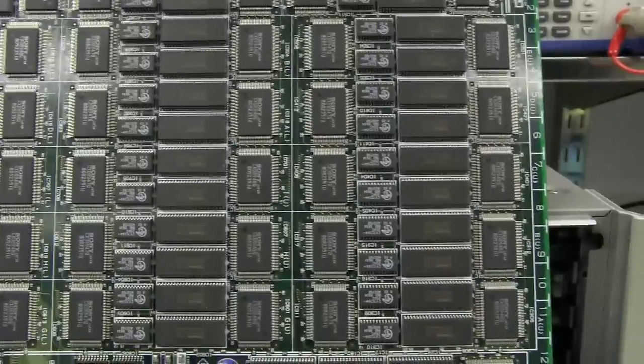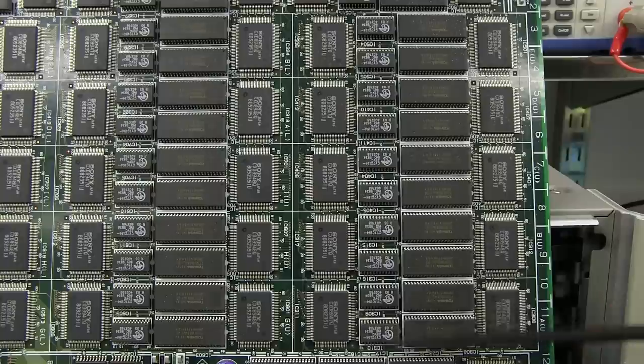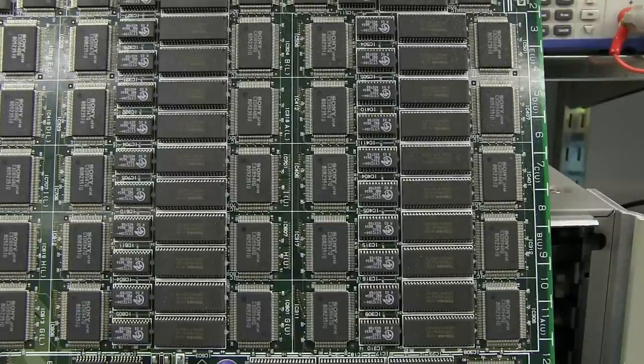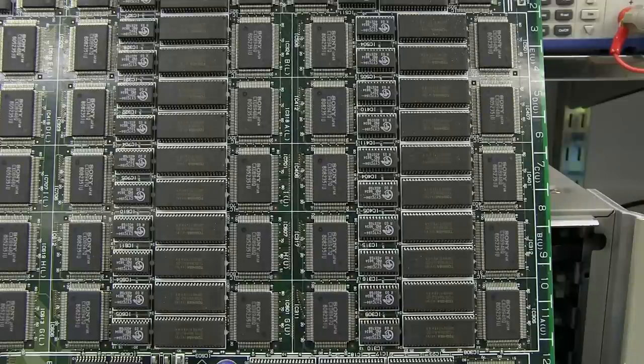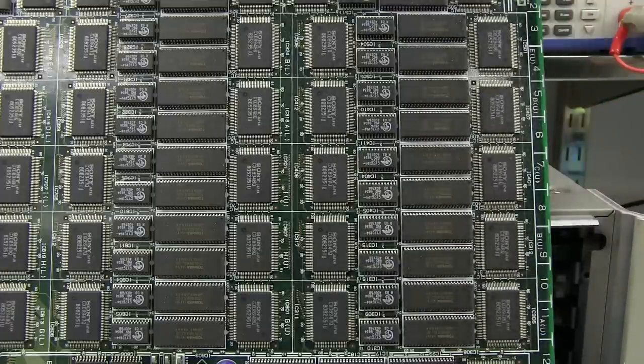And of course, when you want to lay out and route all this sort of stuff in complete modules like this, look at this. Too easy, right? You just do one, and then you can duplicate the route for each particular layer. Depending on the software CAD tool you're using, whether it's easy or hard to duplicate your routing and get your netlist right and everything else, well, that's another subject entirely and is very tool specific. But generally, once you've got that, it's pretty easy to duplicate your routes like that.